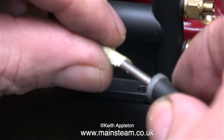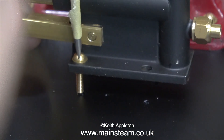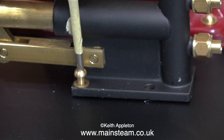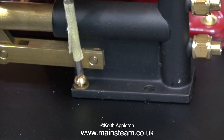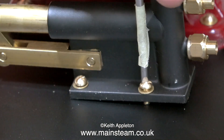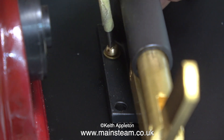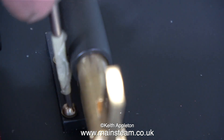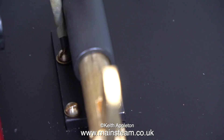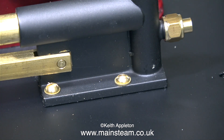Time to fit the hand pump. Before I do, I'm winding some masking tape around the screwdriver, which hopefully will stop me marking the barrel of the pump. These are great pumps — I use them all the time — but I have one complaint: the base should be a little bit wider, which would make it much easier to screw or bolt down without marking the barrel. The masking tape seems to be doing the trick; the barrel is left perfect and completely unscathed. Also, as I fit the pump in place I'm tipping it to one side slightly to start with, which means the screwdriver doesn't actually touch the pump barrel until you come to finally tightening the bolts into the base. The last of the four bolts is tightened in place. There's some marking on the pump body but that's from the lever — you can't do anything about that.